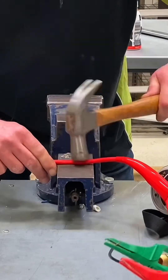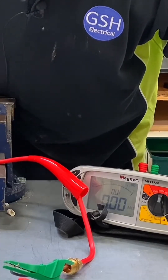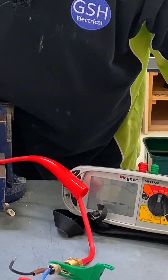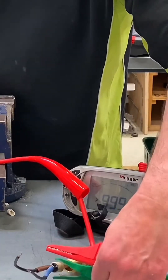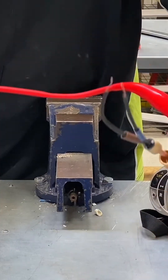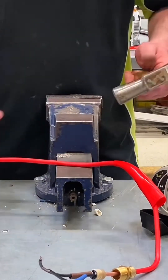I whack it again. That's got it. Let's see if we've got a short to earth as well. We haven't — that one's clear. Let's try this one here. It's only shorted out between the conductors. Obviously at that stage it has failed. Look at how flat we had to get it in order for that cable to actually fail — hitting it onto a metal surface with a blunt object in the form of a hammer. It's dead flat almost there. So we were at stage three or four of hitting it before we actually caused that to break down as a cable itself.